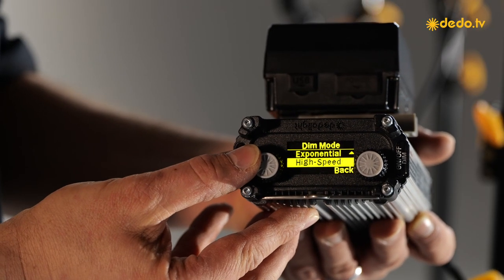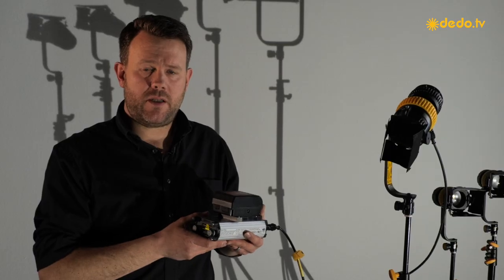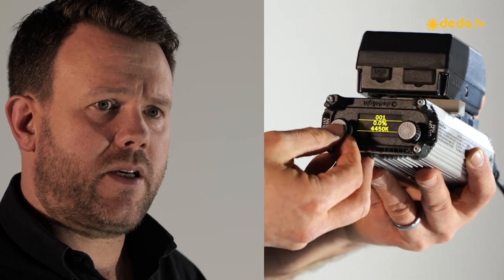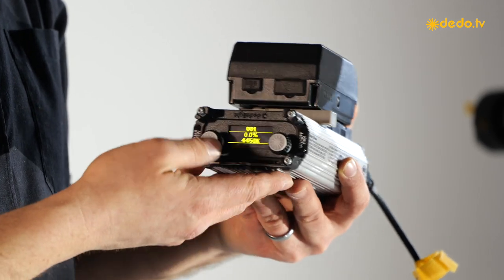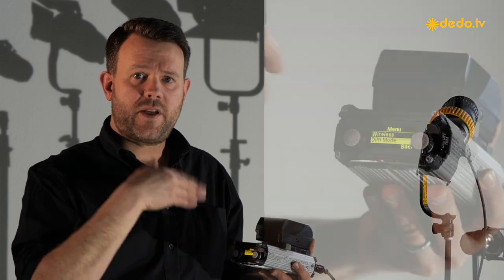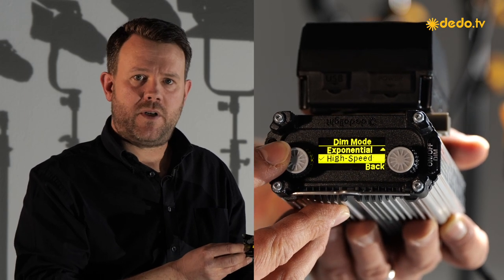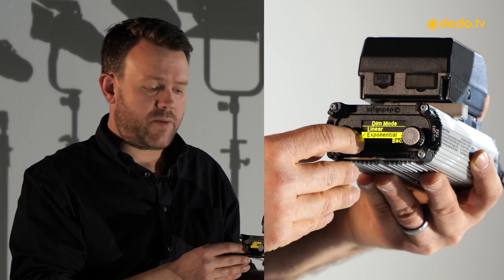Let me talk a little bit about the high speed mode, which we had a lot of discussions about whether to keep inside — because we're totally safe on all commercial high speed frames. We tested with a colleague and the Phantom on regular frame rates used for commercial work. Since we use a high frequency driver with a filter on top, we are flicker free up to 2,000 frames and even 10,000 frames. So in linear and exponential mode, you do not need to worry about flicker at all on your regular high speed rates.